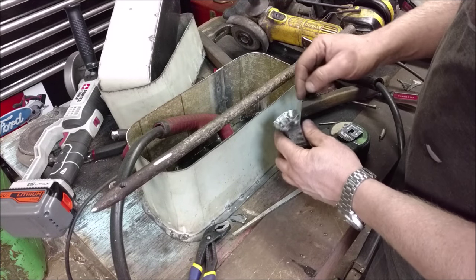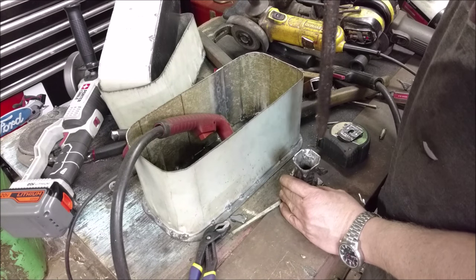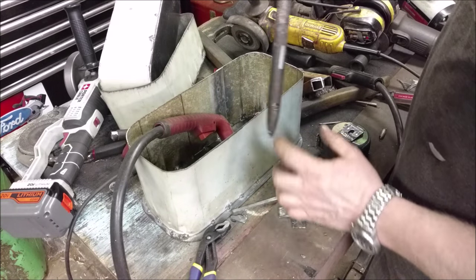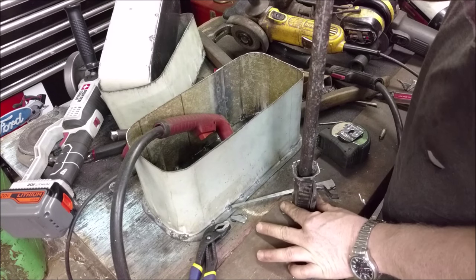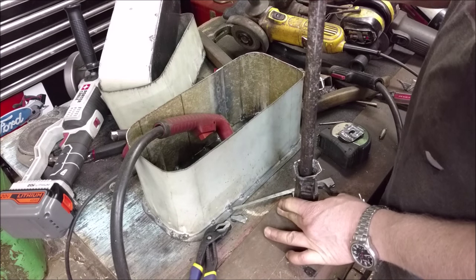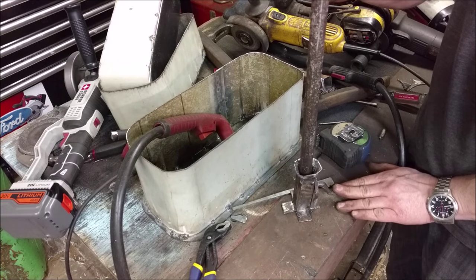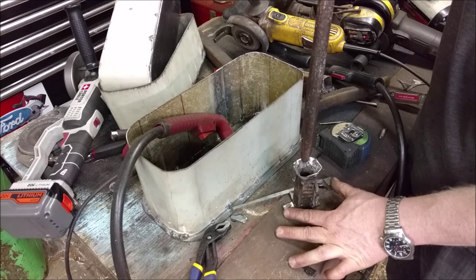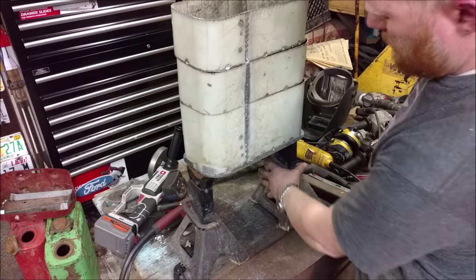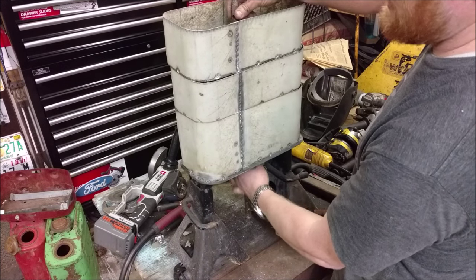I angled the handle and on the bottom I flared it, then welded in a couple other little pieces. This upside down will just slide in, and this will be lined up with that hole — that'll lock in there and hold. It just gives you a little better aim if you hit one of the sides or it's not going in quite straight. From inside the gas tank lid you reach your finger up in and actually push down on that to release it. That'll hold it in there; it mushrooms out just a little bit on the bottom. We'll set this up here and then be able to lock this up into the gas tank, and we'll weld it to the bottom.